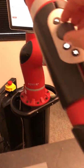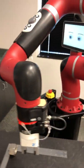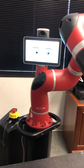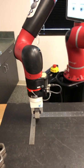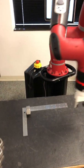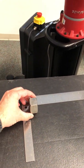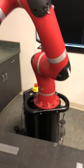When you do that the arm is going to move. The first time you run this, you should be behind the robot with your hand on a button, ready in case anything goes wrong or the arm takes a wayward motion. Notice I'm putting the part back in the same position each time.